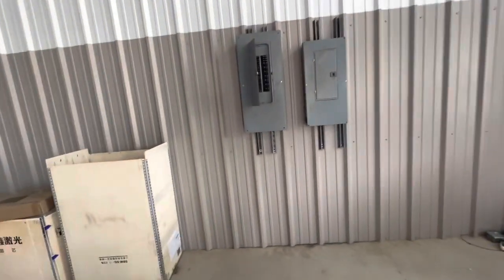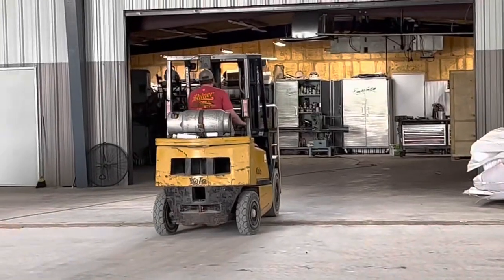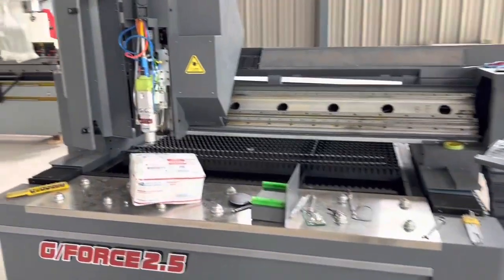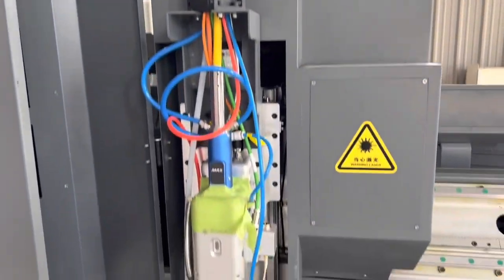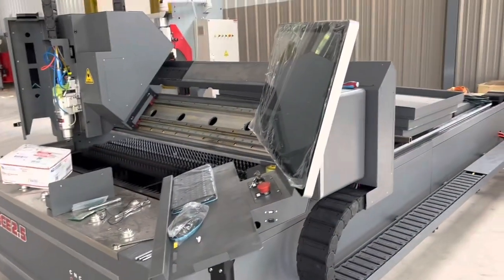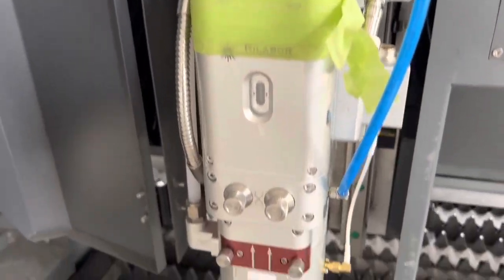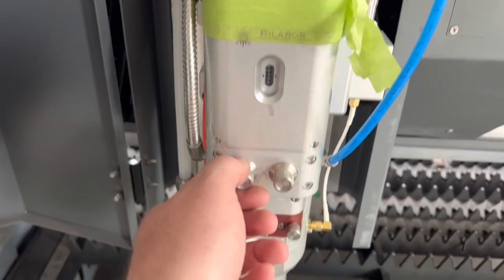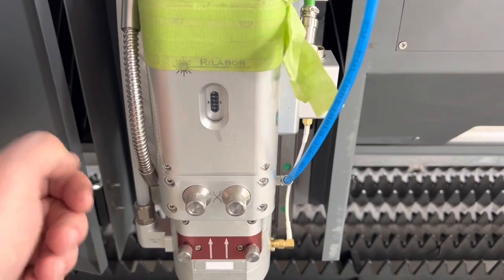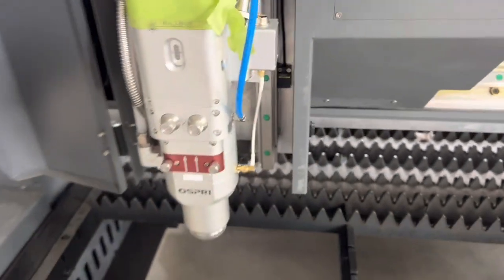Three phase. These were in my old shop and now I've got them back in the new area. You can see Matt on the forklift there — we're getting some stuff cleared out of the old shop so we can do some repairs in there. So this is all ready to go; we're just waiting about another week to get our three-phase powered up. This is a 6-kilowatt, 2.5G accelerating machine — you can see the canted gantry there. This is the Osprey 6-kilowatt head. Pretty neat feature right here: this is beam alignment, beam centering. Normally on most heads you have Allen screws on an angle that you mess with to get that centered up. Kind of handy to have a couple of thumb screw knobs there for that — like a little tune in Tokyo.